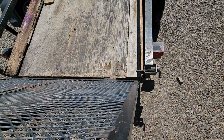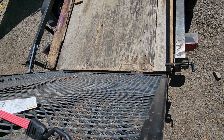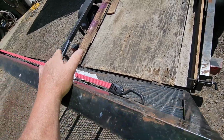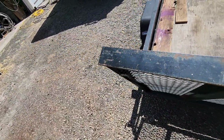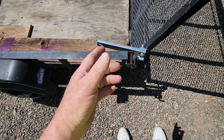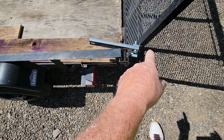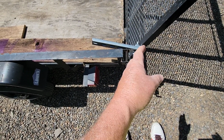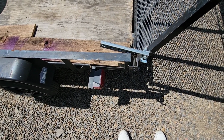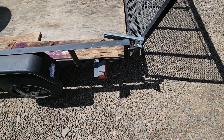So I did a little scrounging. I do have a piece of strut with 1/2 inch round holes in it and not slotted holes. So let's go cut a couple pieces. That one's 1 foot long. That's ridiculously long, actually. So 8 to 10 inches would be fine. Maybe we'll make it 10. And we can do things like put a bolt through there and then weld the head to the strut. Some things that don't need to come apart can be welded and made permanent. We got the time. Let's just build it right, and we can go from there.